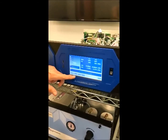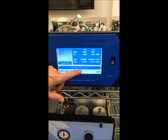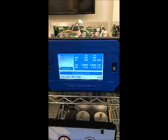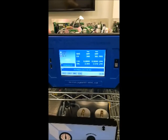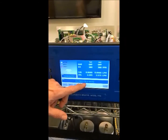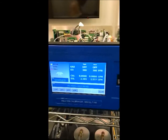Right now I have 2.5 liters of flow going over here. I look at the photometer pressure and I see it's going from about 29 down to 28.5 or 28.6 — so there's 0.4 or 0.5 inches of pressure difference. Between measure and ref, the absorption tube has a different gas going through it at a different pressure every three seconds, and we need to account for that. The measure/reference valve goes back and forth every three seconds and we see the pressure changing — 29.0 down to 28.6, so it's 0.4 inches. If it's more than 0.1 inch, you need to make an adjustment.